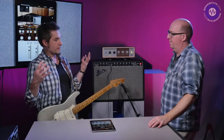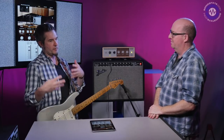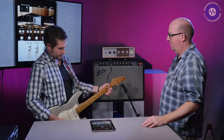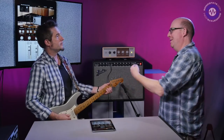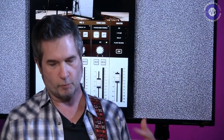That's where the analog side of what Universal Audio does comes into play, because we've obviously got years of experience creating analog gear. A lot of people don't realize how long Universal Audio have been making studio-grade mic preamps. That background of building 1176s and LA-2As and all the mic pres — this is just a no-compromise reactive load box. The tone is still the same. If you don't have that reactive load, things get real splatty and compressed and just feel weird. This still cleans up — you're still getting the same front-end feel, and as a guitarist, it's so much about feel.